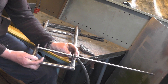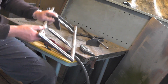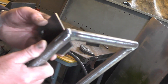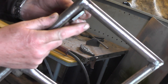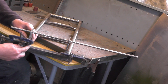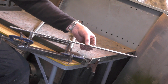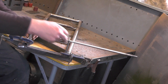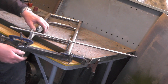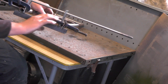I'll put a piece of bar in to line them up and just show you in detail. They're going to fit in the back corner, flush with the top. I've clamped the brackets to the frame and put a piece of 3/8 bar in to keep the holes lined up. I'm just going to tack these now, take the clamps off, and make sure everything's aligned before I fully weld it. You've got to make sure it's parallel to the frame.